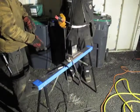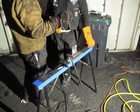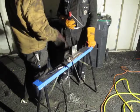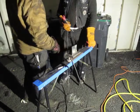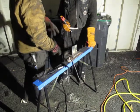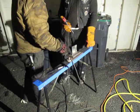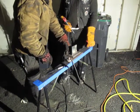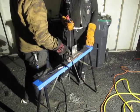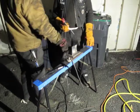James explains the issues: the electrode was about three-eighths of an inch away from the material, so it was just arcing down and spattering. You want the electrode basically just touching the corner of the joint and let it disintegrate as you go along. It might stub out, but work on feeling it touching the whole time. Also slow down your travel speed — you were probably moving about twice as fast as you need to.